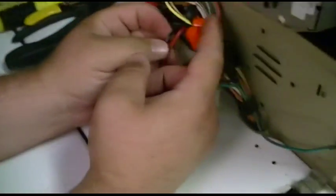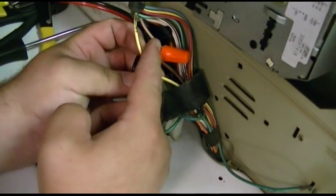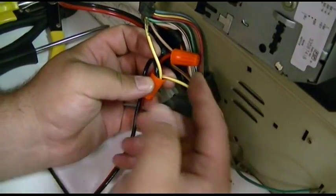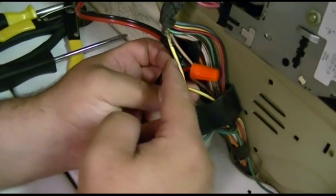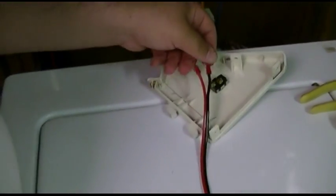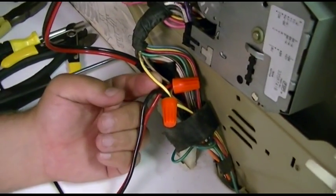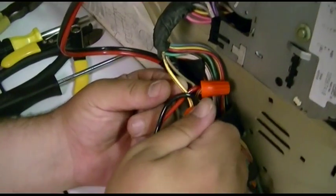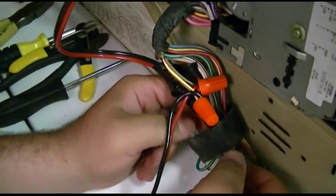There we are — so that's our new wiring, this will go to the switch. What this is going to do is regardless of which of these has power — whether it be the yellow or the brown — it doesn't make a difference. If the brown is energized, power is going to go down the red over here and through the switch, connect to the black and energize the yellow, and that way both valves are going to run. It's that simple — when you get hot and cold together you get warm.